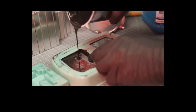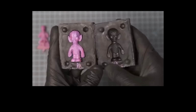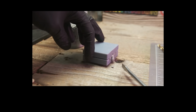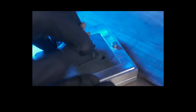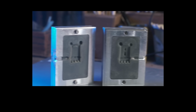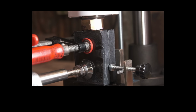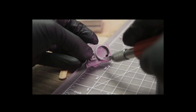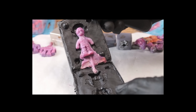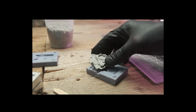So craftsmen got creative and made some DIY injection molds. Remember earlier about everything's a trade-off? Well, that's certainly the case again. Because yes, we were eventually able to get results, especially when using the metal mold box. That gave us encouragingly high amounts of parts from our homemade molds. But there would always be an issue with DIY molds, like exterior warpage, interior damage, common things like short shots, or ones I never considered, like the mold does not let the plastic cool down.